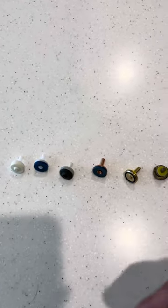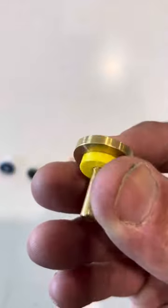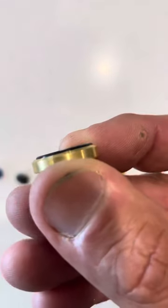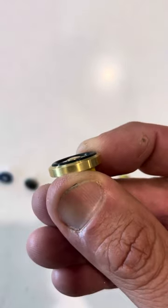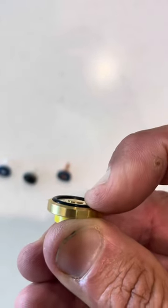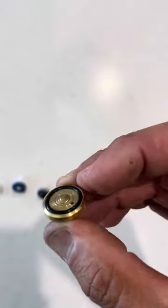Last of all, if you can get the ideal situation, then your hydro seal tap washer is where you want to be. You've got the strong brass body and minimal room to deteriorate the seal, providing it's sealing off on a quality seat face.